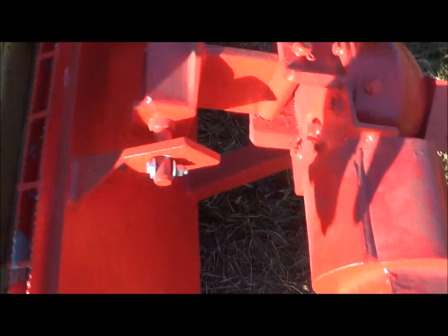I had to build a big counterweight off to the side. This is a piece of pipe right here — I took some other pieces of 3/8-inch wall pipe and just started layering the outside of it, then welded on a huge chunk of steel I found. The inside of that pipe I filled with a bunch of rusty bolts and sealed it up, so it's just whatever you can do to get it kind of leveled out.